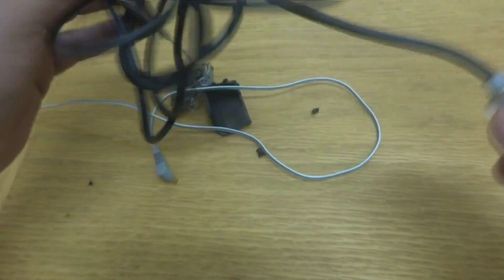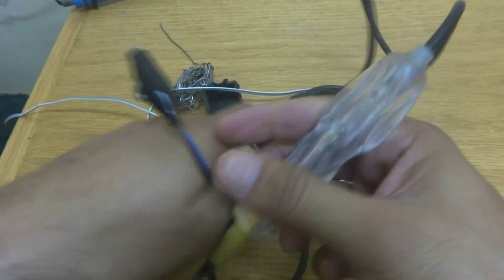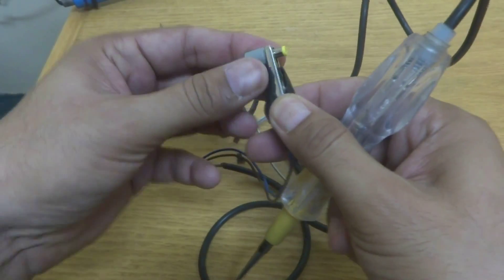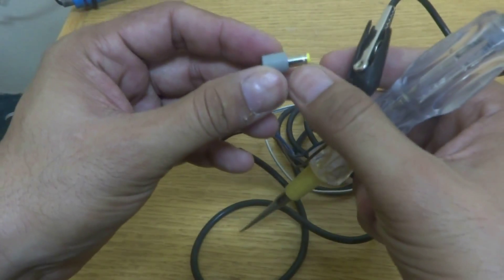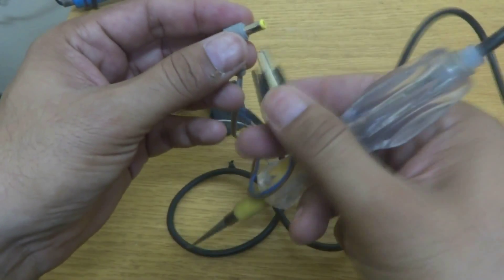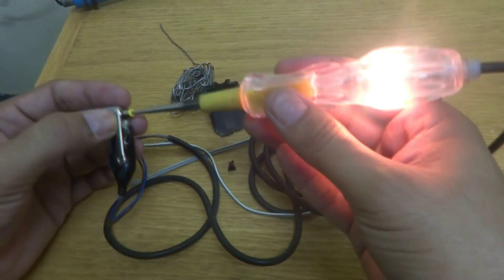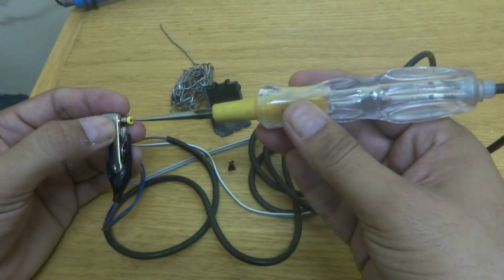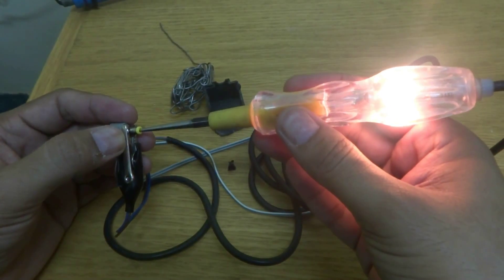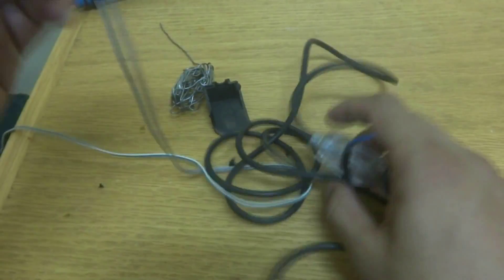Here is my automotive tester, which I use very frequently. This tester is rated at 12 volt but can start from around 3.3 volt. There are two terminals — the outer is the negative and the inner is the positive. I connect negative and positive and look at the tester — you can see this light is illuminating, which means there is power. The power supply repair is confirmed working.